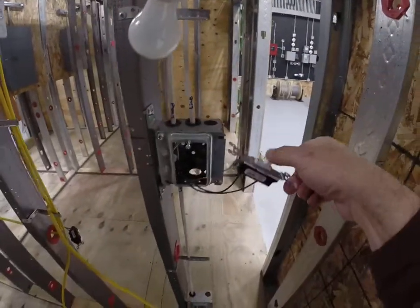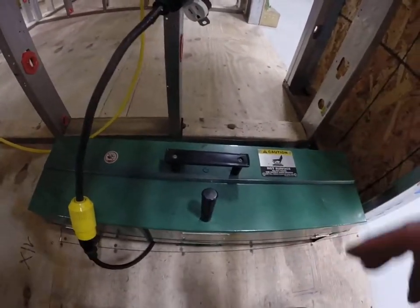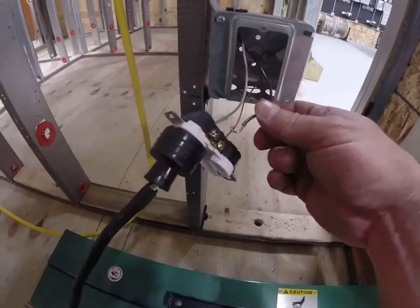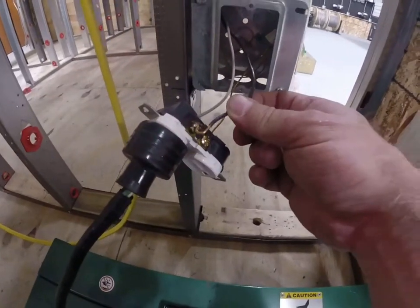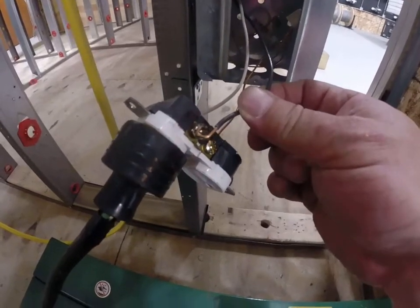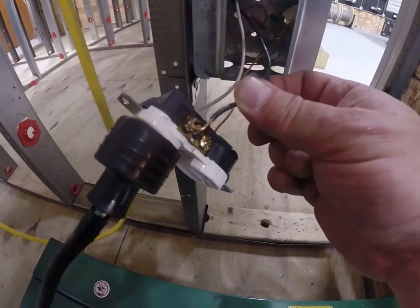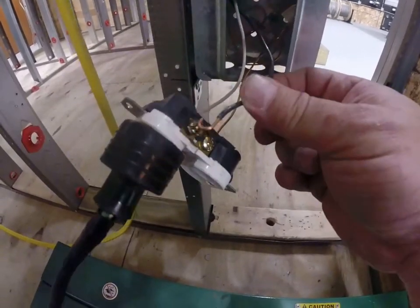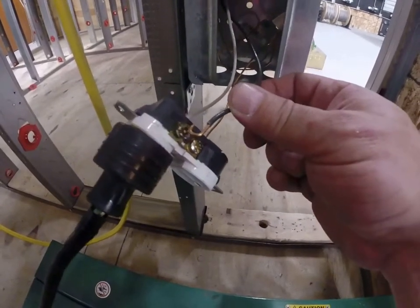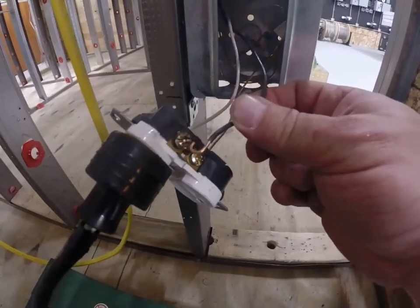Let's go to the next spot which is more evident. I have a 15 amp PVC hotbox — quite a big load — and I'm going to take this and just look at the sparking. As long as this thing is sparking, that means the breaker hasn't tripped yet. My question is: why is this thing that's supposed to give us the protection we need not tripping the circuit breaker with an arc and a spark that's as large as this?